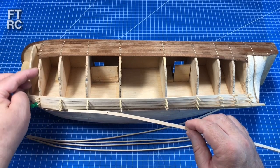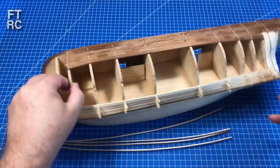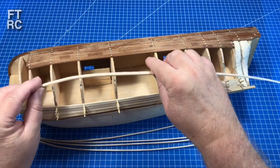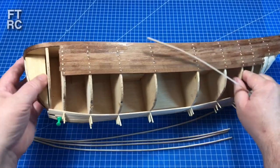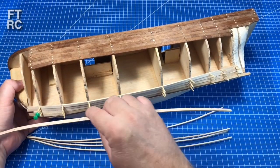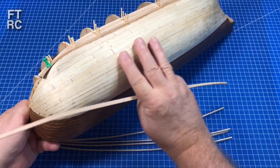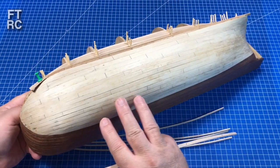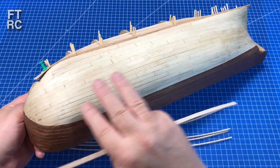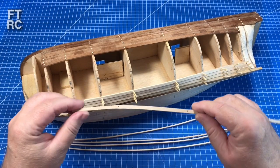At my C rib I'm cutting my planks because I'm going to balsa wood in the bow — if you're not familiar with what I'm doing, this will all be balsa wood in, exactly as the stern has been. The idea is it's easier with thick planks to just bend a simple curve rather than bending complex curves. So we do the simple curve with thick planks, balsa in the front and rear, and then when we lay our thin planks on top they bend much easier over the balsa, while still having the structure and rigidity.